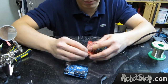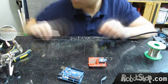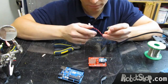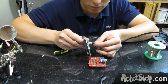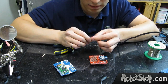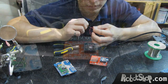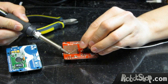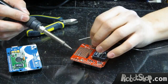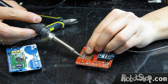Let's solder it. We have this cable, so we'll just cut it and use it to connect to the VRBot board. We need to connect the black to that pin, and the red to all this line of pins. For this, we'll join all these lines of pins together by soldering, which will make one big node. And now we need to extend this node to the next hole. Now we have two big nodes and we can connect the wires.